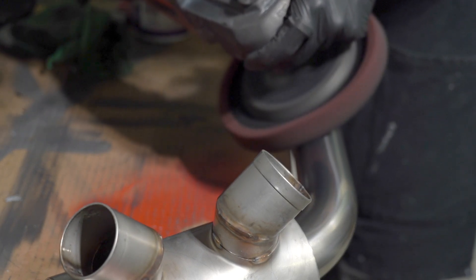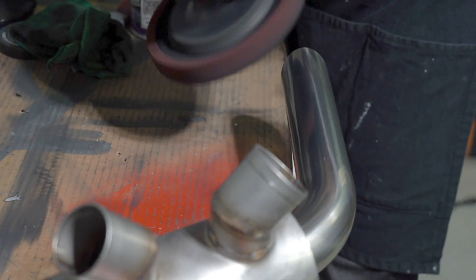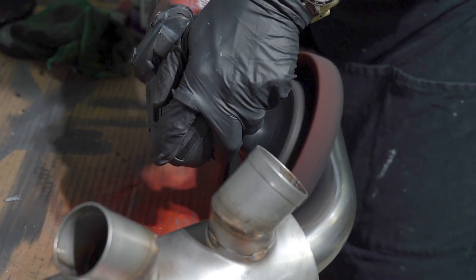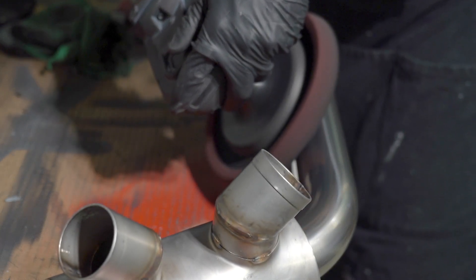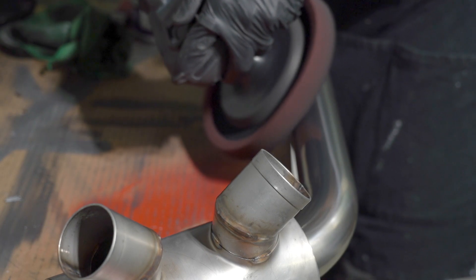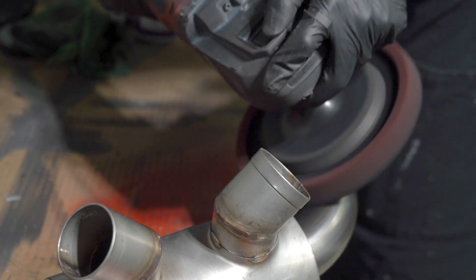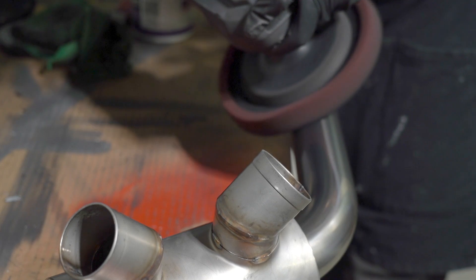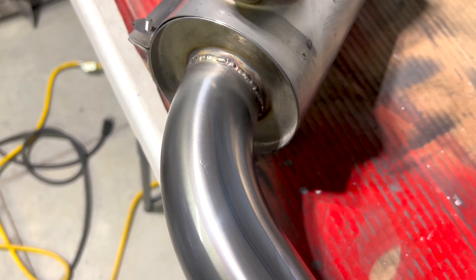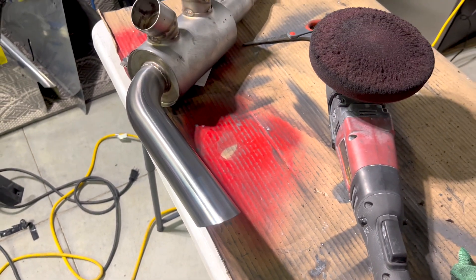What I did do is get all the scratches lined up. If you look at that rotary pad - you notice it's a foam pad. At the 12 o'clock position where it's touching the metal, the pad is moving more or less in a horizontal direction, from left to right. If I were to polish with the 3 o'clock or 9 o'clock position, that pad's moving up or down, so my scratches would also be up or down. By lining up all my scratches from left to right, it gives that same brushed appearance and the holograms aren't as distracting.